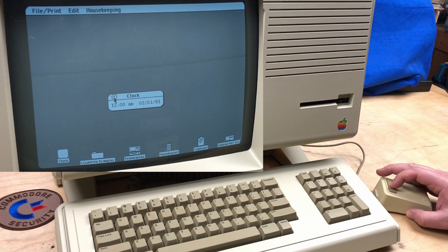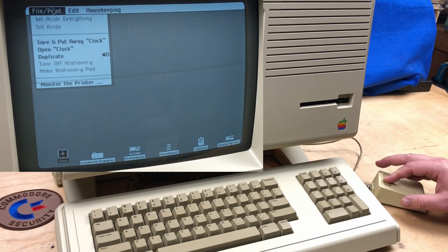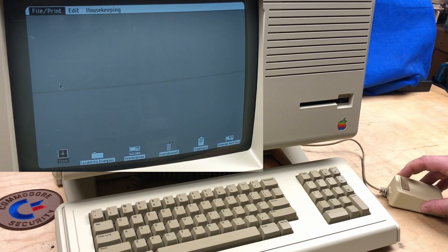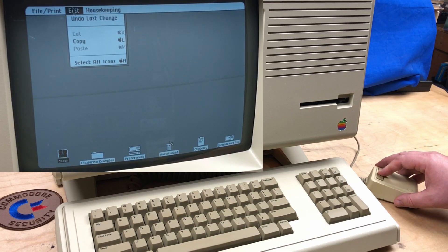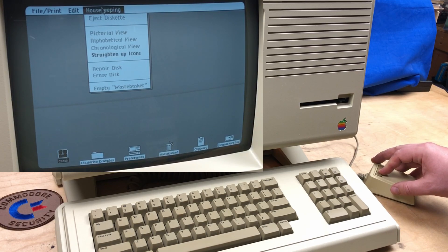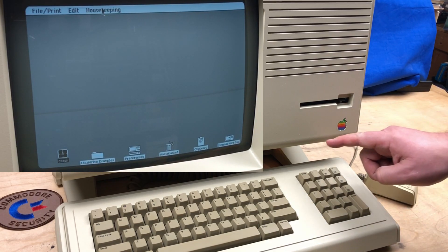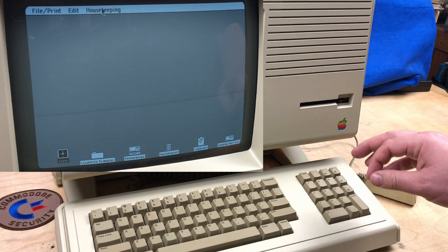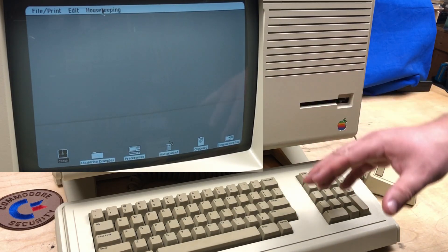You can close the window by double-clicking on its top left corner. On the regular desktop, press and hold the single mouse button and it gives you some options. There's no option to shut down the computer here — it seems the only way is to press the power button. But it's a smart switch: when you press it, it shuts down any running apps and then shuts down the computer.